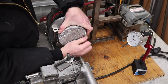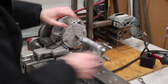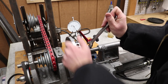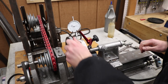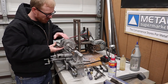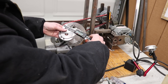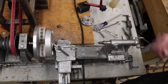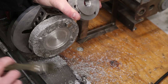I'm using those 1-2-3 blocks again — they're tapped on the largest sides, which makes them easy to secure both to the face plate and to secure the part to the blocks. I used a dead center in the tailstock to help hold this part roughly in the center while I secured it to the face plate. I machined down a little shoulder so that I can register this adapter plate with the new modified adapter plate, which will allow me to match-drill the holes that will mate with the chuck onto this new adapter plate.